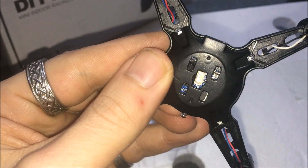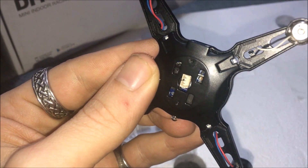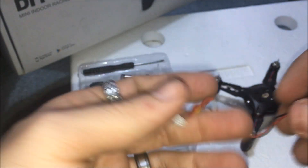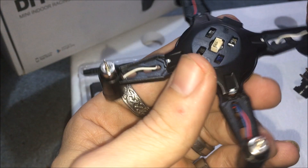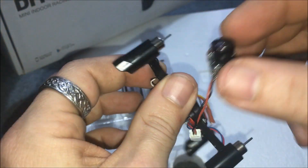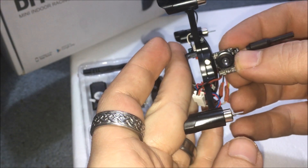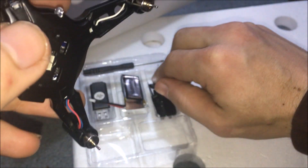You can see up top there's a camera port — that is live. It's meant to take a Wi-Fi camera, but you can hook a 5.8 gigahertz camera to it if you wire a plug correctly into your camera, which I'm going to show you. This is just an all-in-one 25 milliwatts and I have a plug running into it — the proper plug. I snipped that off of an X5C's camera, and that's how I got that. This is just going to plug and play. You just need to look at your holes and look at your prongs and make sure you're pushing them in correctly. Now the way I do it, because the wires are a little bit long, is I underdog it underneath one of the arms. I'll show you at the end — it's simply by cutting a piece of double-sided tape and it will sit right there very nicely. If you use the right type of tape you won't ever have to replace it — I use a double-sided duct tape, which isn't duct tape but it's a duct tape brand.